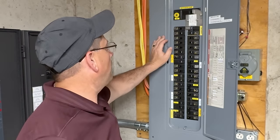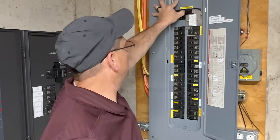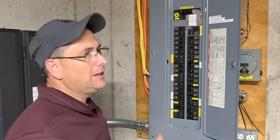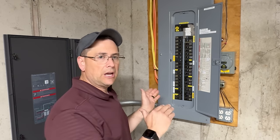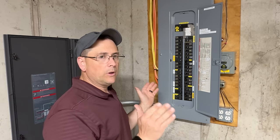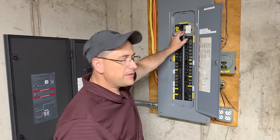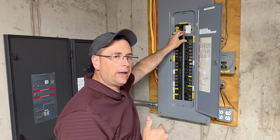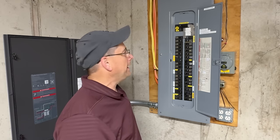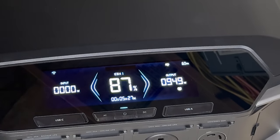So I have the studio lights turned off again. Now we're going to go ahead and turn off the master breaker for the whole house. You're going to hear a quick click and a little bit of a blink. That's how fast it transfers over — that little dinky blink. In my testing for the next video, I have an oscilloscope hooked up and we're going to be showing the waveform pattern — it's flawless. Right now we're able to flip the generator on if it was running and charge our batteries, but currently I don't have any solar. We're running on the actual battery system right now at about 948 watts.